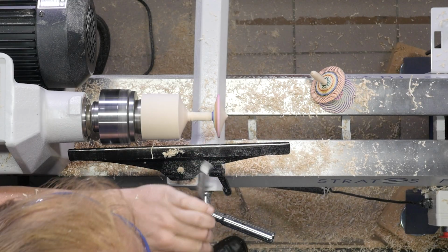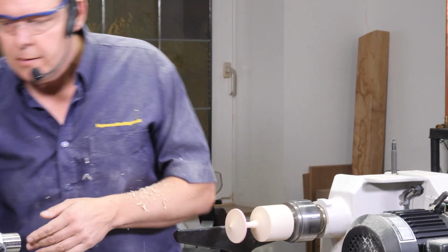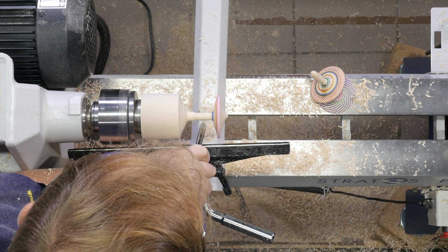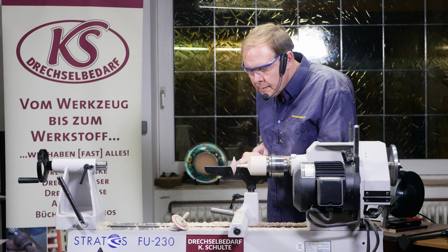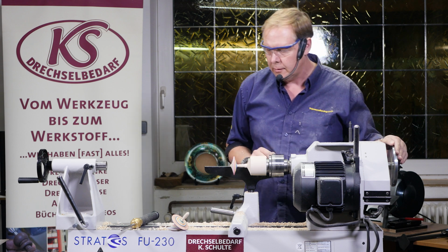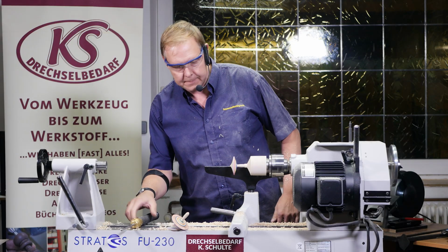We'll drop down to a smaller 3/8 cryo roughing spindle gouge in just a sec. Just allows me to get into tighter gaps. Just make sure I'm happy with that cut on there. It works better if this is thinner, but obviously the thinner you go, the more at risk of that sort of breaking off, so you've got to be a little bit careful here.